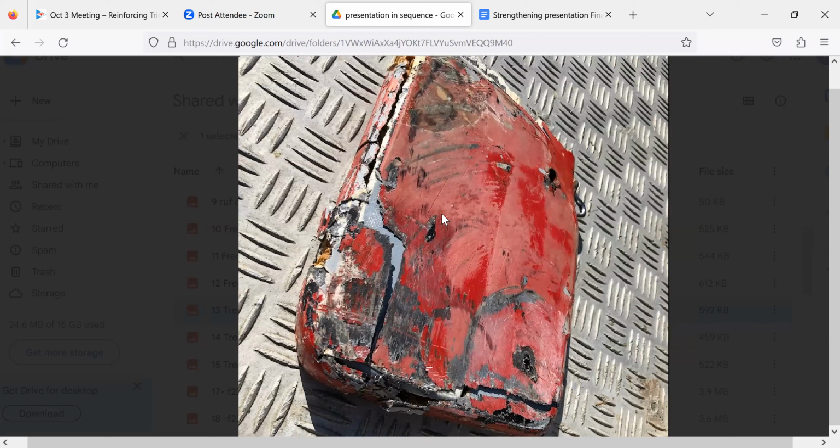Step one. We got out the grinder and we started going after this little stress crack. And right, there's two little cracks. It was right at the re-entrant corner, which we talked about as bad, right? It's like a 90 degree point in the rudder, and all the cracks were radiating out from that inside corner, which is not a good sign.